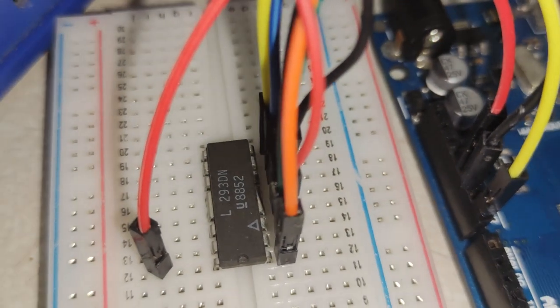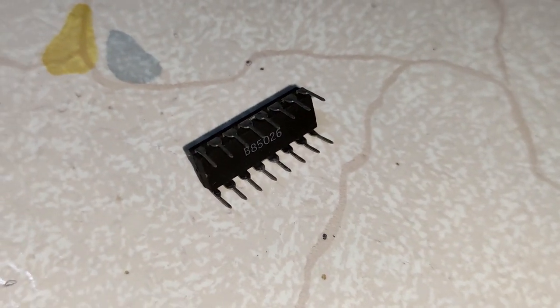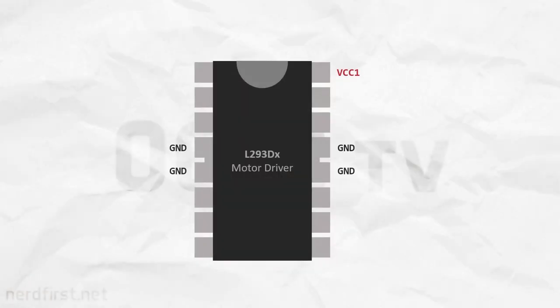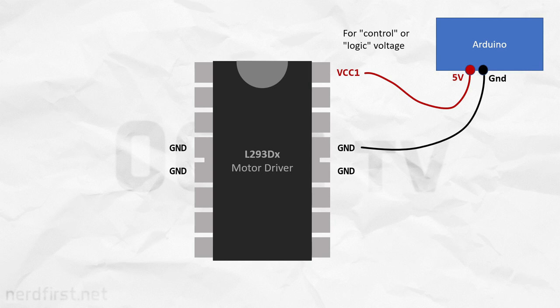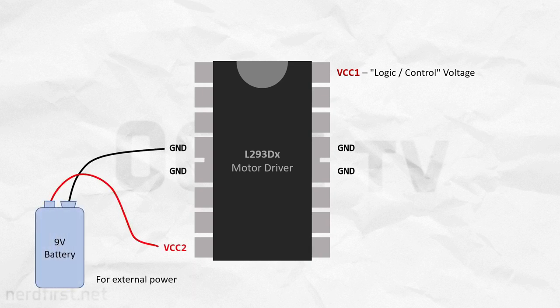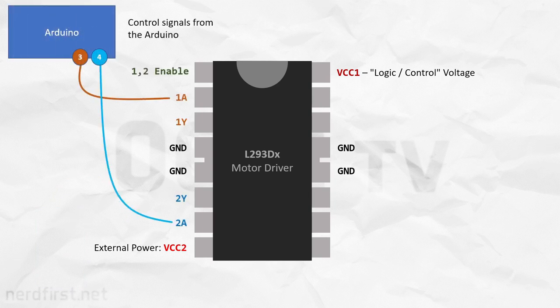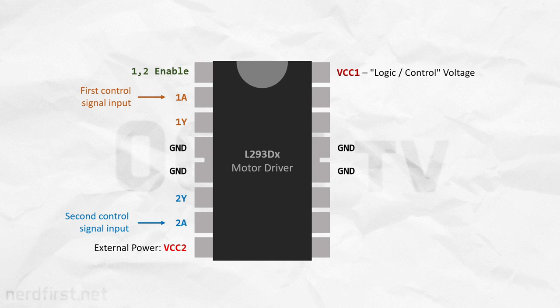Let's end things off by taking a look at an actual physical example. What I have here on a breadboard is an actual H-bridge motor driver chip. This chip actually consists of motor drivers on each side of the component. On one side, a voltage is provided by the microcontroller — this is the signal voltage. The other voltage comes from an external source, which is used to drive the motors. The two pins labeled A receive control signals from the microcontroller, which tell it to open and close a different set of those virtual switches. The two pins in the middle, called Y, are your output pins, which can then be connected to a motor.